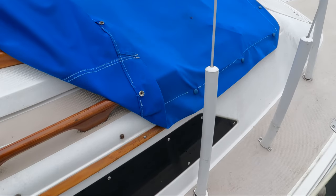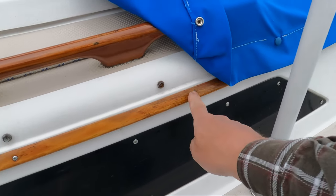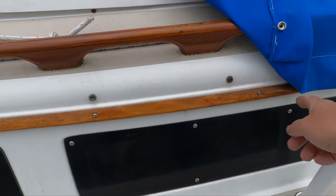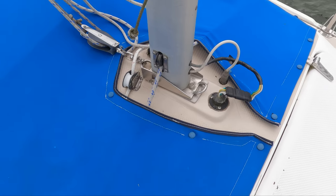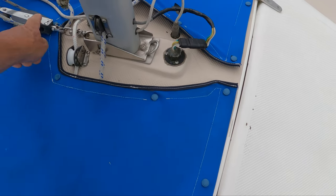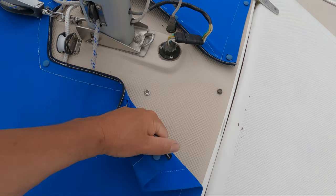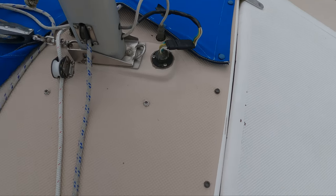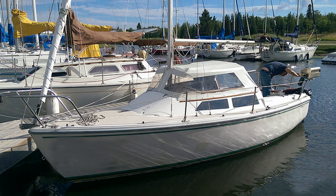To keep the natural look of wood on a boat in its environment of sun, wind, and rain, one has to be committed to a regular routine of upkeep with oils or varnish to combat the sun's UV rays, drying out by the wind, and moisture entering the wood grain where dark algae grows. Oils require monthly applications, and varnish means a couple additional coats every year. The only help in prolonging the oils and varnish is to keep it out of the rain, wind, and sun, such as a boathouse or canvas covering.